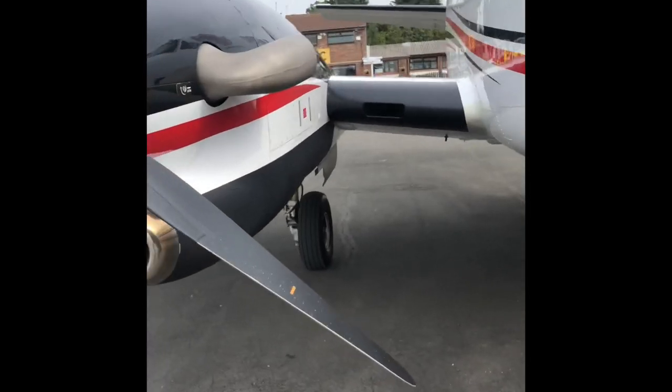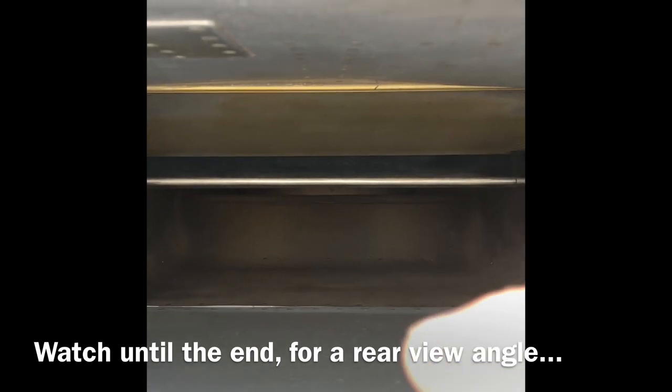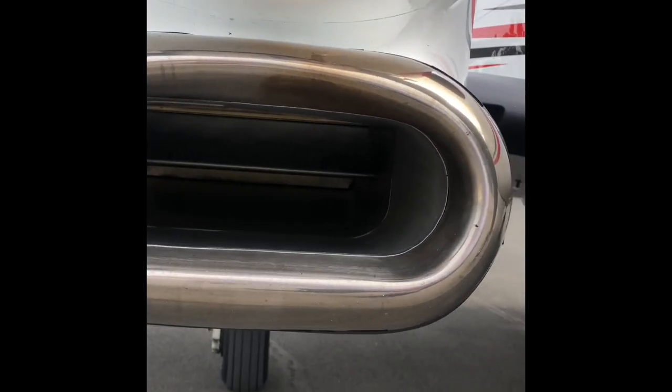I'll go to the other side and we'll do the reverse. At the moment, if you look very closely, you'll see that the flap is down and that at the back the door is open — there's a gap in there. Now go for it. See how that flap now comes up. Watch what happens with the door in the back — see the door coming down. So that's now with the door closed at the back and the flap lifted. All available air now goes into the engine, which is why you see the performance rising when the engine anti-ice is turned off.